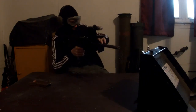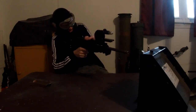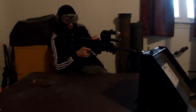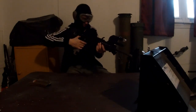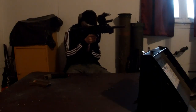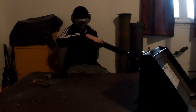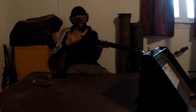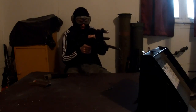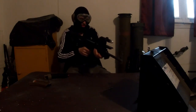I'm getting hit with little pieces of spall coming back, so that's not very pleasant. But overall, I'm getting used to how spongy the trigger is. My bolt did lock back, so my charging handle doesn't latch — it's just a little wiggle between the two. If I take my magazine out, it will return. The trigger's not resetting because I need to mess with my trigger spring. I can stick my finger back here and force it — that's because I have the bottom open for emergency access. I'll make a version that's open on the bottom and one that's not. But overall, I'm pretty impressed that the trigger fundamentally functions, because it's just riding those pickets in the middle and I thought I'd have more issues with that.